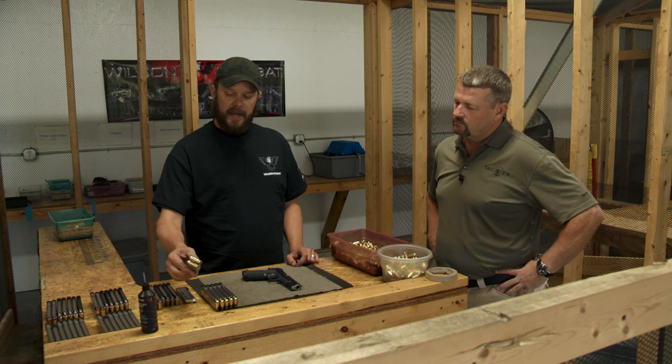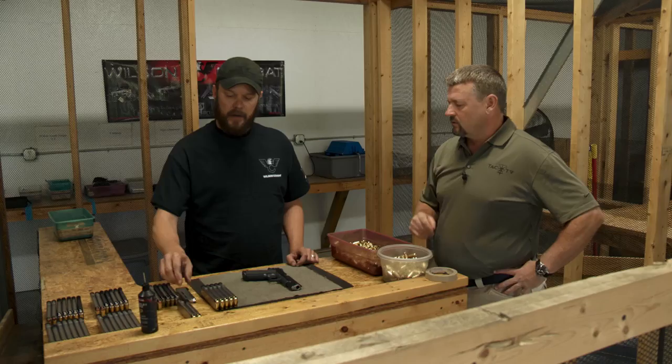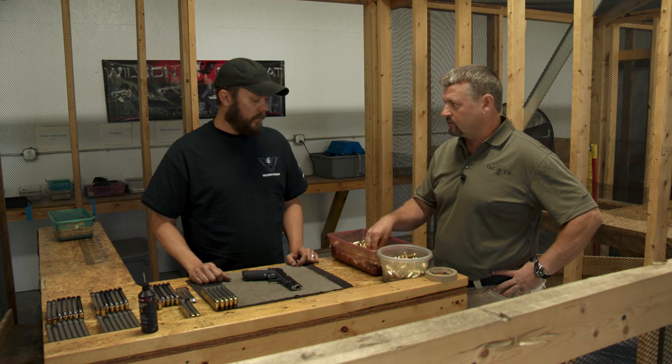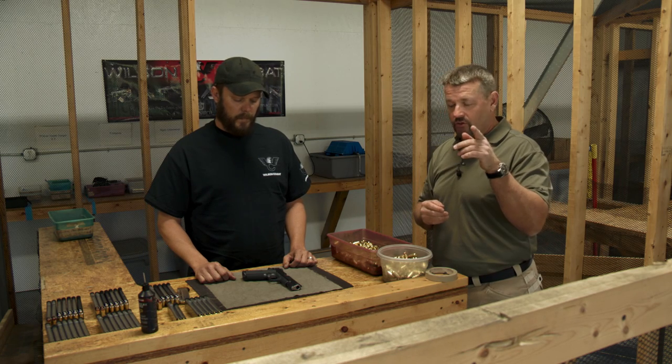After that we have two more magazines — one eight-round, one ten-round — of regular ball ammunition. That's a fast fire just to make sure it's working with the intended 230 grain. This is factory ball, not reloaded. That's critical because if you know what you're doing at home, you can actually build better ammunition than manufacturers do, particularly in feeding in the 1911. Taper crimp is a critical part of that. So shooting factory ball ensures the gun you're getting from Wilson will work with the ammunition you buy off the shelf at your local retailer.